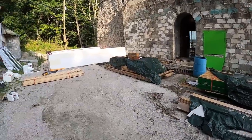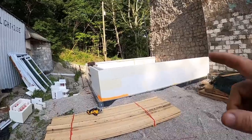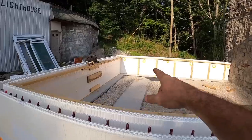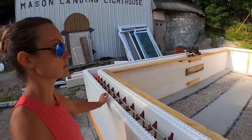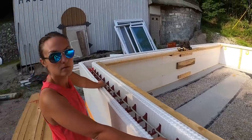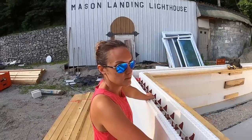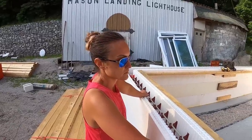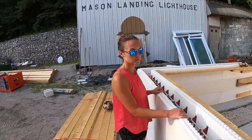All right, so what I did, honey, was I confirmed our dimensions. These vertical 2x4s that we have over here are what we're going to screw those 2x12s to. Each one of those will get a 2x12, okay? So I measured them. Everything measures 18 feet 1.5 inches. There is a quarter of an inch we could add to that, but I don't want this to be tight. I want this to go in easy, go together easy, and we don't have to fight it. So we're gonna cut them